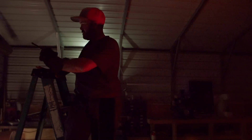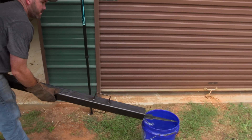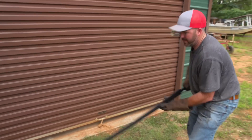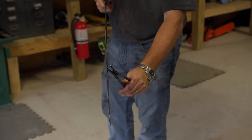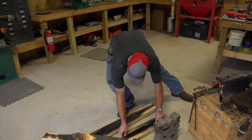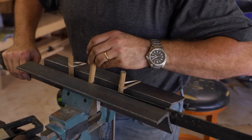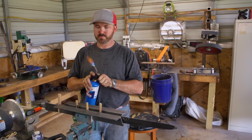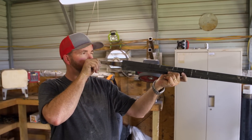I'm worried that hitting the bottom of the quench tank did some damage. I tried to fish it out, but unfortunately I didn't catch anything. Ended up pouring it out in the five-gallon bucket in my yard. I got the blade out, so it's all good now. I did pick up a slight warp close to the tip. I should be able to straighten that out during the temper cycle, so time will tell. My biggest focus is going to be getting the blade straight. My solution is to extend the width of the jaws with some angle iron, heat it up, and use some wooden dowels to put the proper pressure where it needs to be. She's straight.